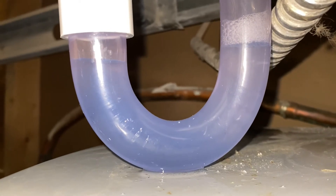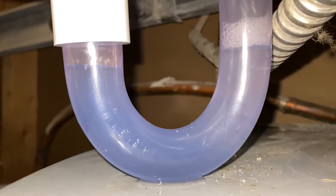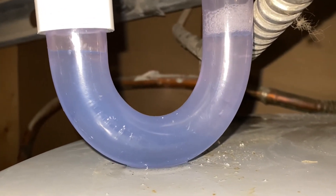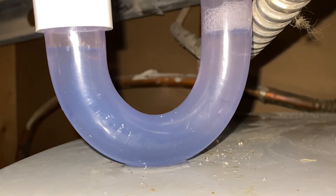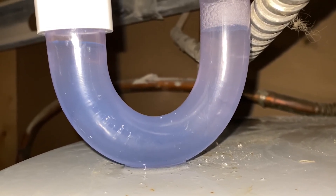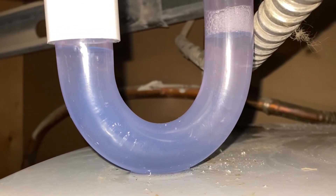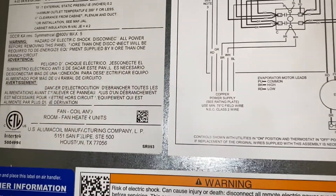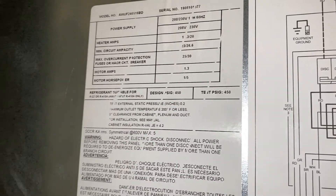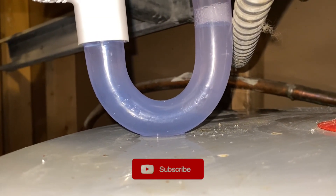It's pretty cool with this P-trap — it's a clear pipe so you can see. This basically tells us there's about a half-inch difference right there, which means we have a half-inch static pressure differential in the air handler — which is pretty cool to see. That's actually probably what this is rated for. That's good to know if we're doing any kind of calculations about airflow and horsepower — it's good to know what the static pressure is.